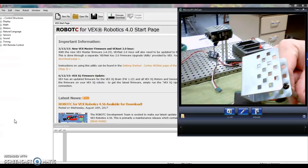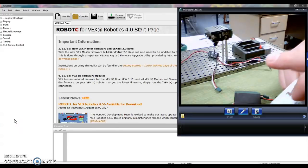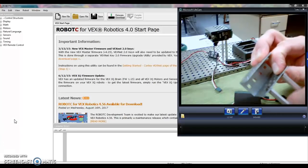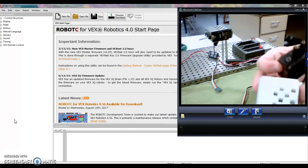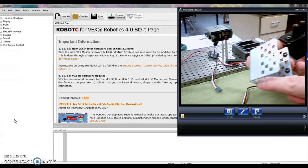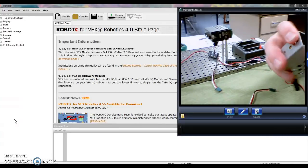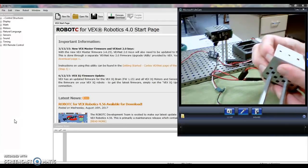Here's one. To do the other one, I put the screw through the U-shaped bracket, then hold that in place and screw the other spacer on. Now for the motor — I want to attach it with this end lined up with one of the holes in our bracket. I'm going to make the two gold screws of the motor line up with the holes in the U-bracket.